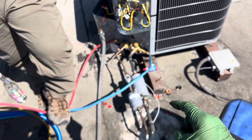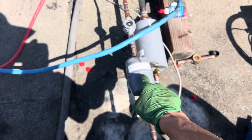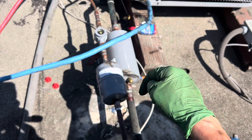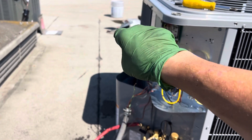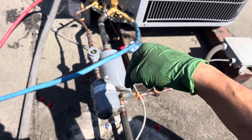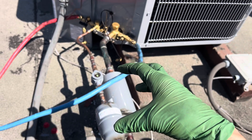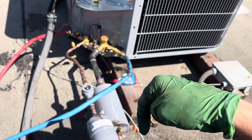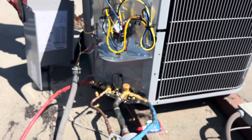This one came with a little factory Puritex filter. I wanted to size up bigger but they didn't have the liquid line size since this was a burnout. I measured the oil: one liter came out, and the compressor came with 1.24 liters — meaning about 240 milliliters of that overheated oil is still in the system, down in the evaporator and the lines.